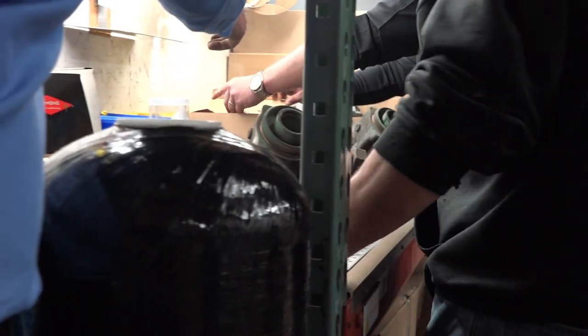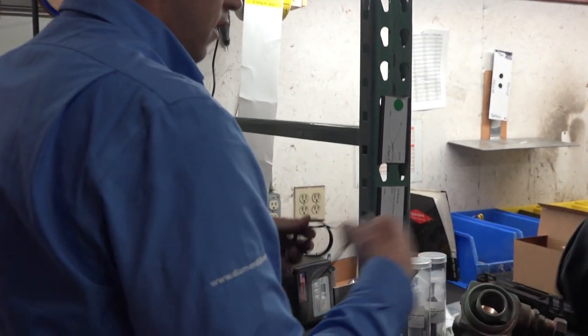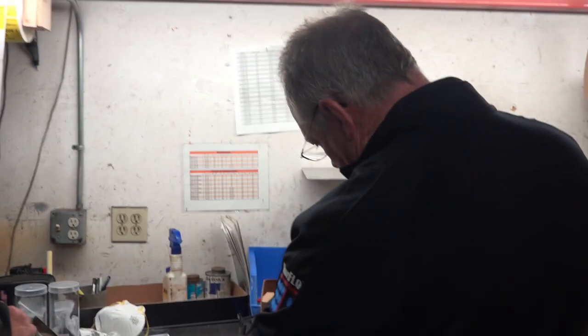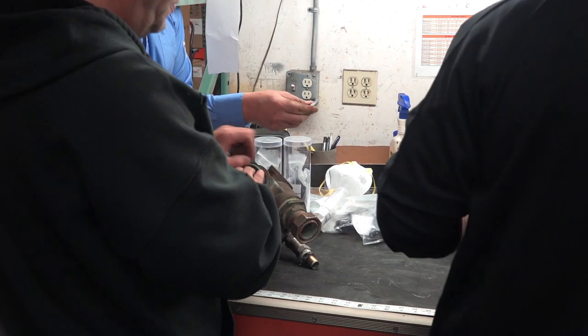If you want to hand me the lube, right inside the box. A little goes a long way, as with most grease. You just make sure they're well covered. That's the O-ring and your distributor O-ring. A little slimy. And if you want to throw a little extra grease in, just to make sure it sticks in there, that's how it comes in handy.